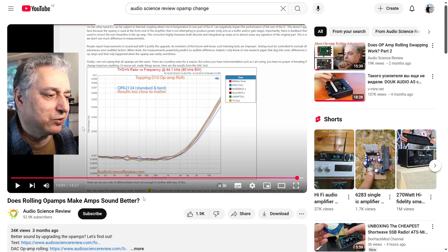At audio, in general, everything is simple. There are a couple of challenging places in audio design. One is a good microphone amplifier — making one with 60 dB gain capable of working with a one millivolt signal from a dynamic microphone is challenging, and not all companies can make low-noise preamplifiers. You need specific low-noise equipment and low-noise components, and everything in the signal path matters, mostly for the first stage gain. For the second amplification stage it's not important anymore. Another challenge is size and thermal considerations. The rest of things today is easy.